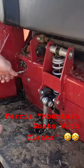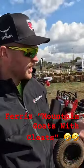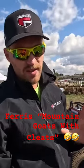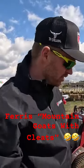The Hydro Gears are serviceable — those are 400-hour service intervals. A lot of guys that have the Vanguard oil guard system, which is 500 hours, just do them at the same time to keep them on the same rotation, so that's nice.